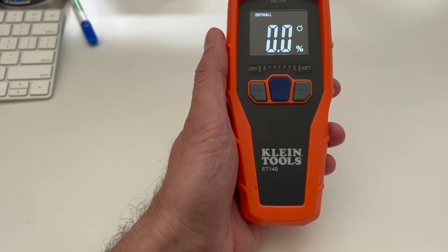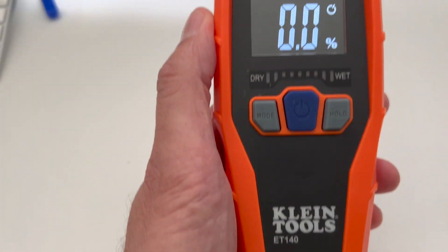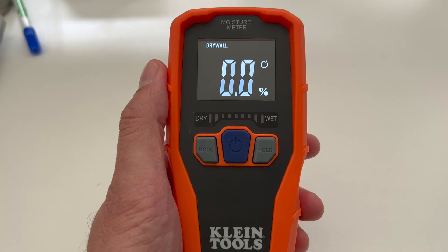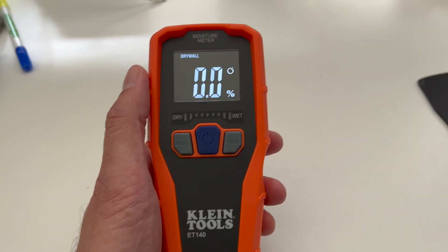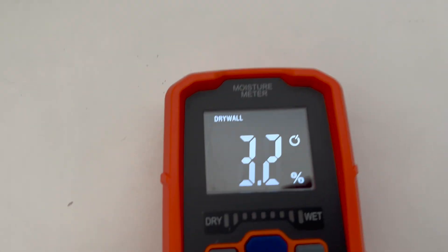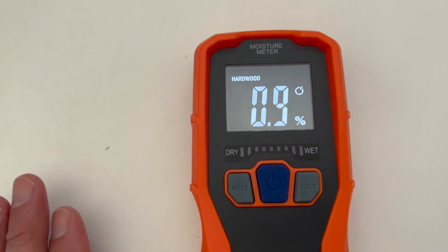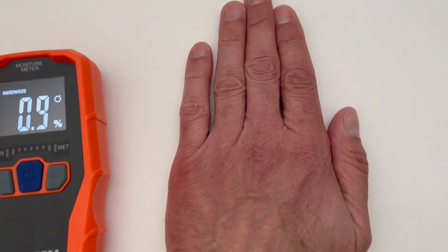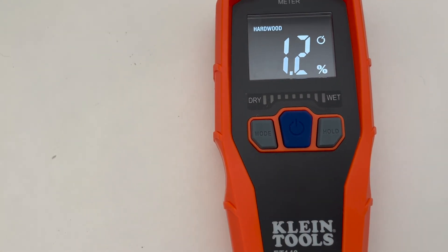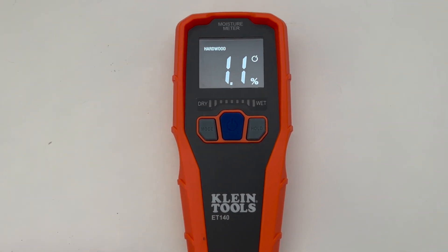So that's just a short test of this tool, which is a moisture meter. It helps you check if you think you have a leak. You need to consider outside wall versus inside wall and the difference between them, but it's a handy tool for checking moisture problems. Even this table reads 0.9, probably because I touched it — it's measuring the moisture left from my fingers. As always, thanks for watching.